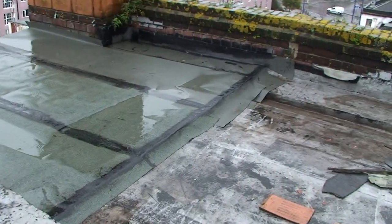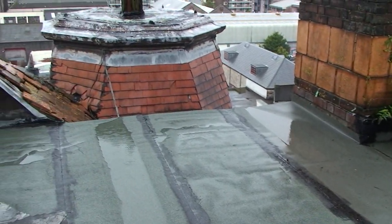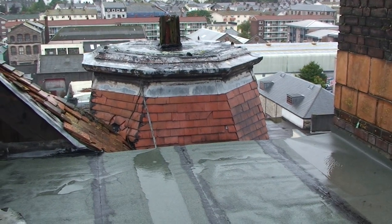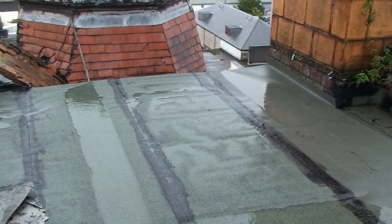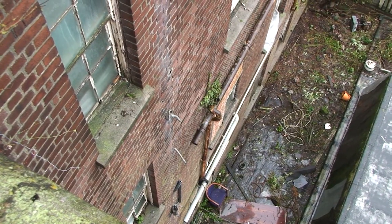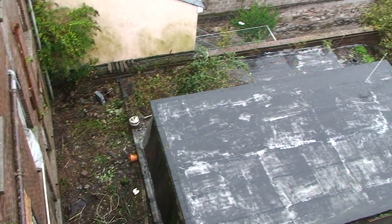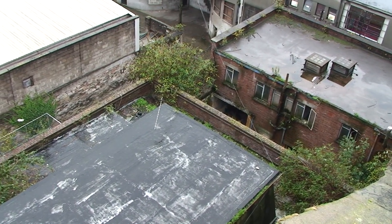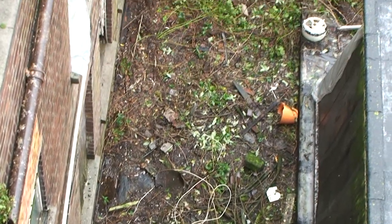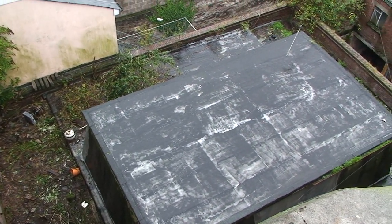The last bit we'll do is that section there — we'll use that to get in and out from the roof. This whole section here had collapsed and was missing, which is why we had to shore all this up before getting up here. I didn't want anybody disappearing through the roof, so that's all been shored up and is now watertight. This is the roof of the atrium of the Great Western Hotel. As you can see, it was totally overgrown with vegetation and all the glass was missing from the panels. What we've done is seal the panels up around the side with polystyrene and rendering, and we're in the process of removing the vegetation so we can make the actual roof itself watertight.